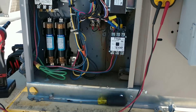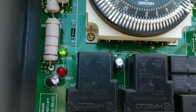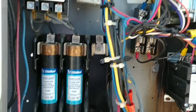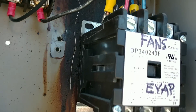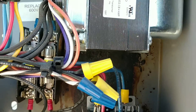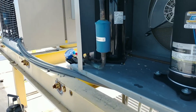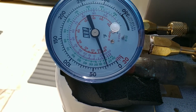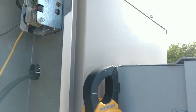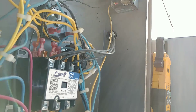Removed the panel and just starting to look at the obvious before I start testing anything. We are calling for refrigeration. Looking at the obvious — I can see all that crud. This one looks pretty new. So I put a pressure gauge on this and we are sitting at about 20 psi. I noticed that my low pressure switch is open.